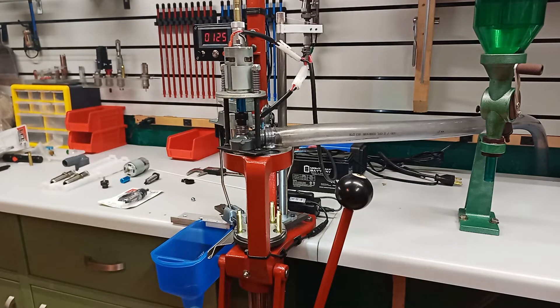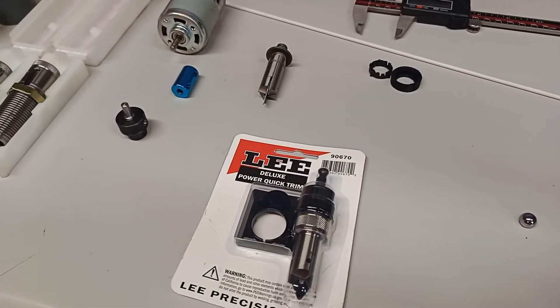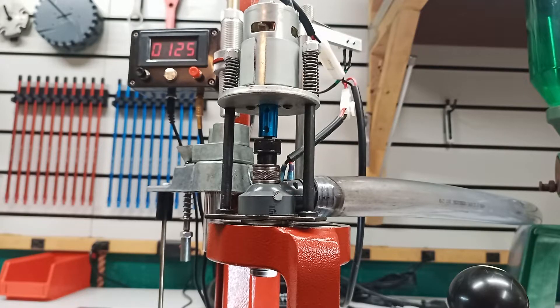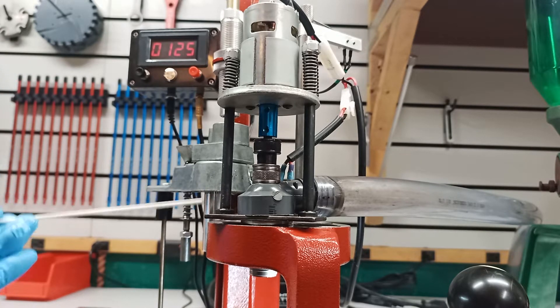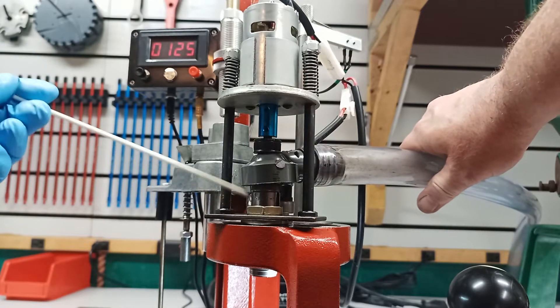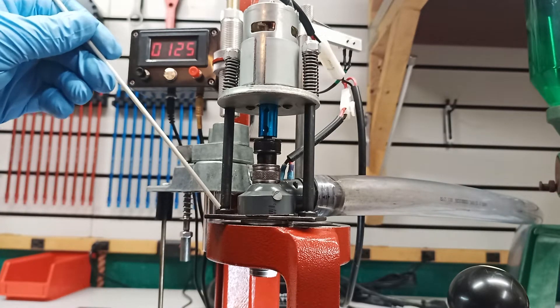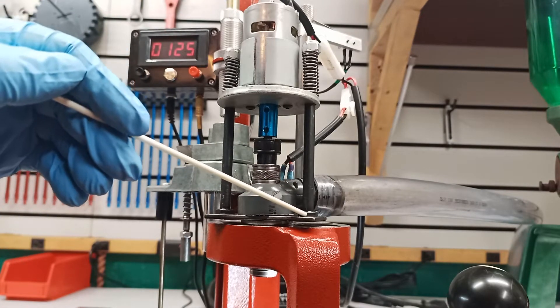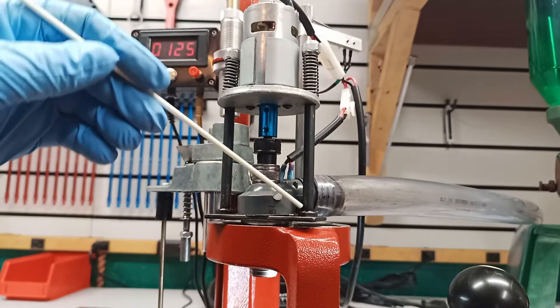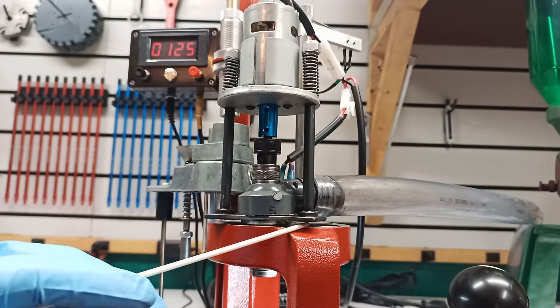The starting components for this press setup are the Hornady Lock and Load AP press and the Lee Deluxe Power Quick Trimmer. What I did was take a piece of eighth-inch by inch-and-a-half flat plate steel, drilled and bored it for the die body in the center, then drilled and sized these bolts to be press-fit into that plate. They were welded from the back side — the back of each bolt was machined to fit the hole, pressed in place, and then welded and machined flat on the bottom side.